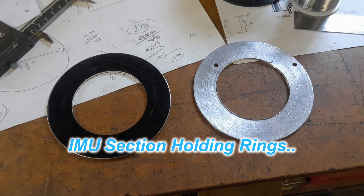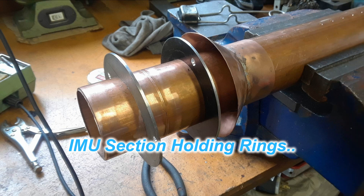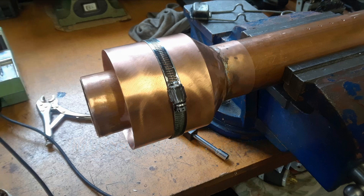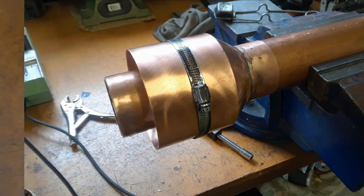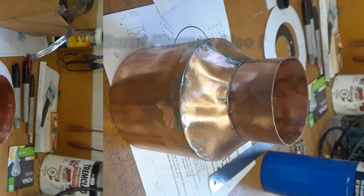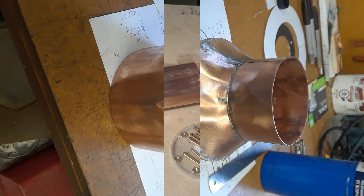The outer pipe and cone of the launcher itself has to be perfectly concentric and true to the waveguide pipe, or your pattern will be way out of whack. So I learned to build two rings to hold everything in place while it was being soldered. With a hose clamp holding a copper sheet snugly around the two aluminum rings, I proceeded in soldering it up. Then with a sandpaper flapper wheel and a die grinder I cleaned up the solder and removed excess solder from the inside as well.